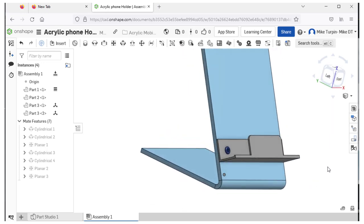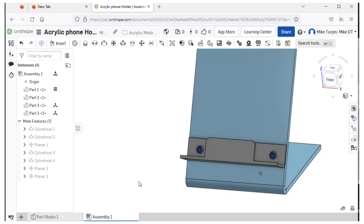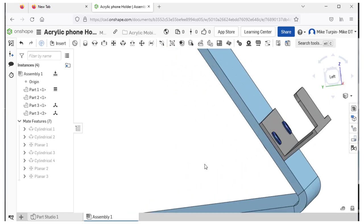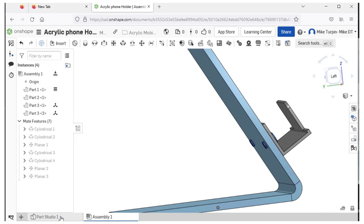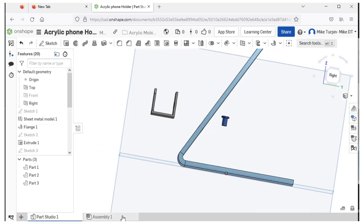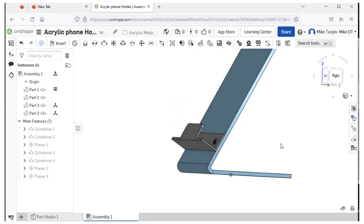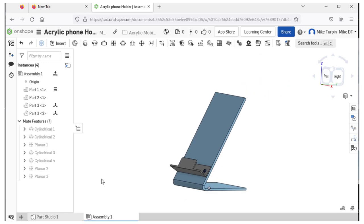And that's the thing with parametric designs, that it takes the various components, and any changes you make, it will apply them. So if I went into my rivets, for example, I could increase the length of them in that part of the drawing, and they would then appear longer in the assembly, or if I use them again. So that's really key.